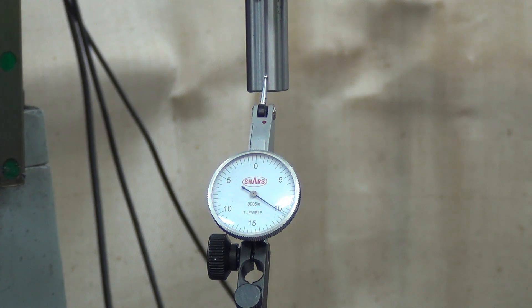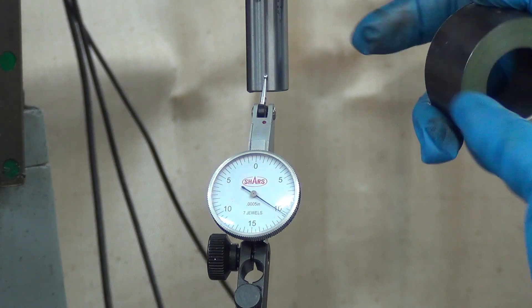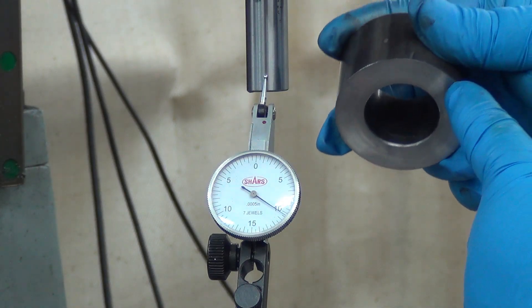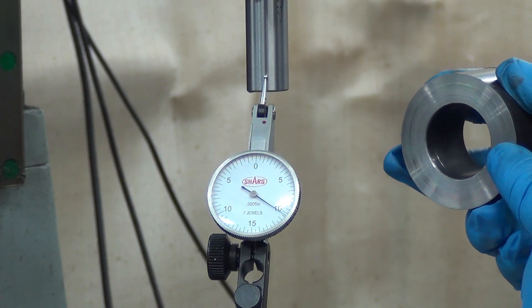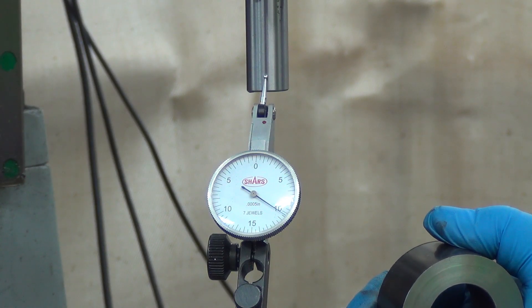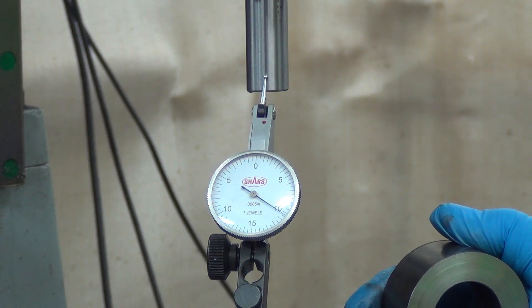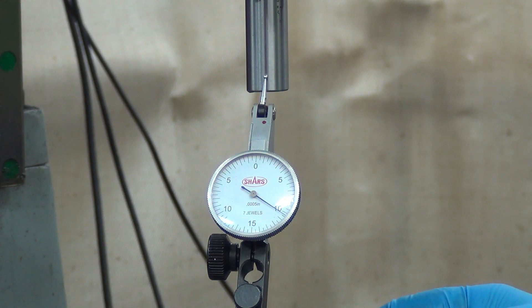The reality is, if I'm going to grab it from the inside, cut the outside and the critical bore on the inside, they'll be perfectly concentric. Then when I take it over I'll be off by up to ten thousandths when I put the fillet on the back side, which isn't critical at all. Ten thousandths — that'd be about five thou per side. I think I'm going to have to cut one or two and try it and see. I may also take the jaws out and look at them to see if there's something going on with the jaws too.